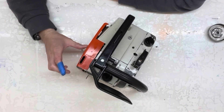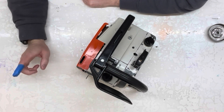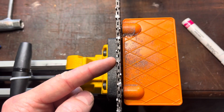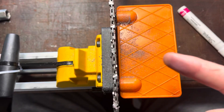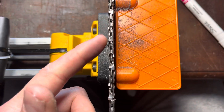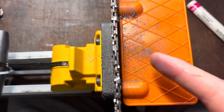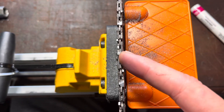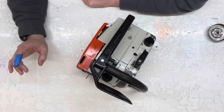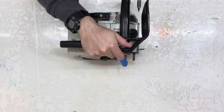So here's a quick sound of the piston slapping in this saw. Also, you may have noticed that this saw was the one that wasn't self-feeding very nicely. I found the issue - I believe this to be it. The bar rails are actually closed correctly, but the drive links themselves are worn.